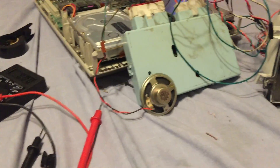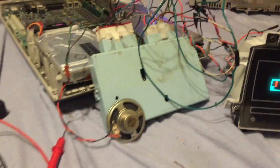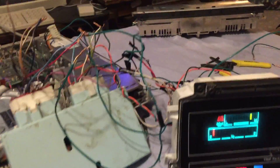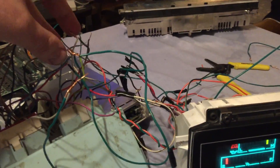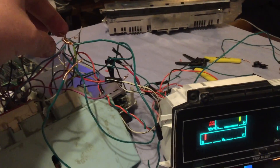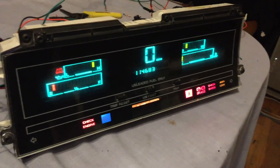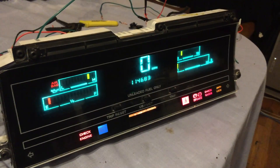As far as the control module over here is concerned, we have not yet gone anywhere — the engine's just been sitting and idling. So if I were to ground this speedometer sensor here, which works on a pulsing ground, it should tell us to fasten our seatbelts because it believes we haven't fastened our seatbelts yet. So let's see if it will do that.